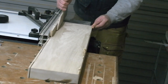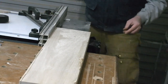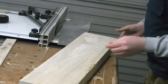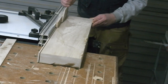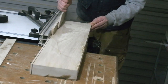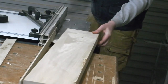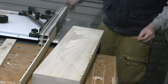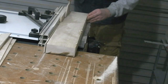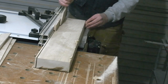Later in the video when the forms are made, I will show you the glue up and the results. Why am I starting at the table saw? I'd rather be doing these on the bandsaw to lose less material, but mine's just not playing ball in terms of consistency at the minute. I'm starting at the saw because for a new form, that's where it starts. You'll have a radius for your curve in mind — mine is a fairly gentle 1010 millimetres outside, so I think 4 millimetre rips will work nicely, but it needs to be checked.